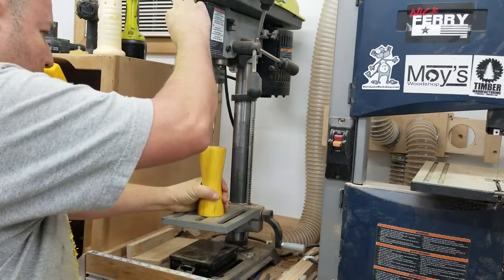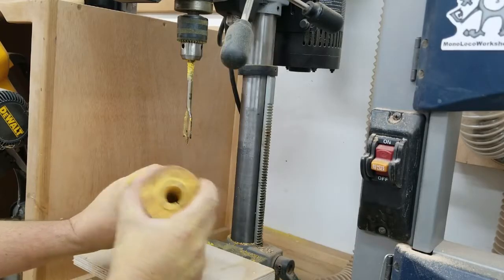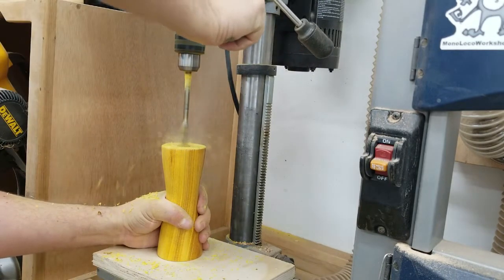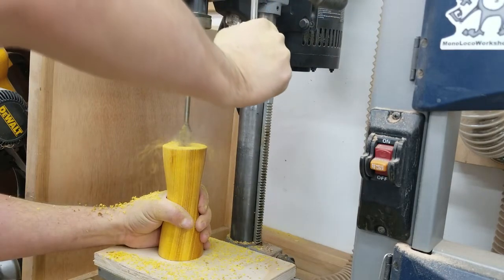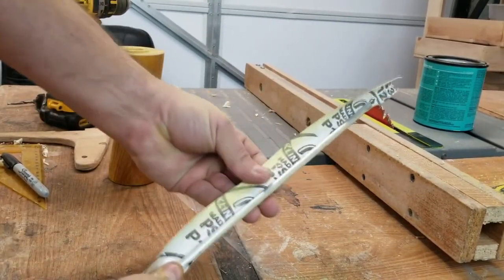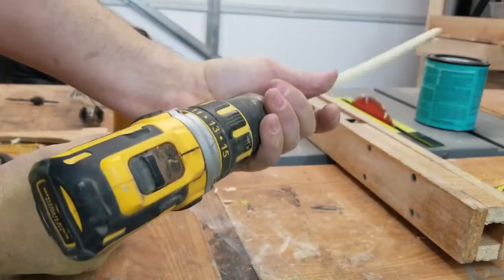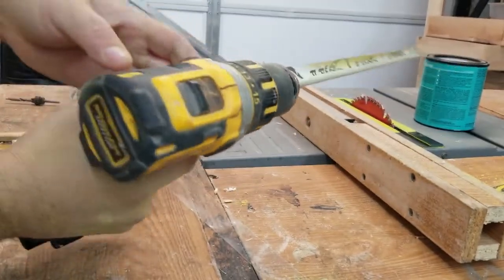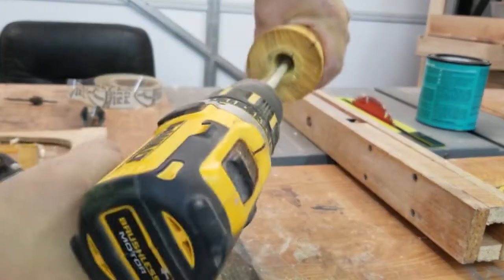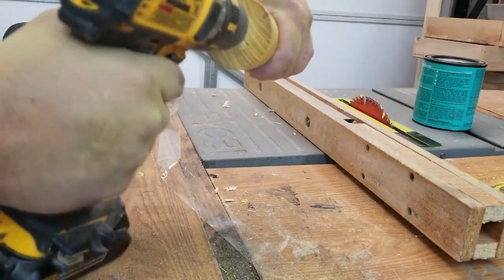After cleaning up the ends, I'm going to be using a 1-inch spade bit and the drill press — drill about halfway through, then flip it over and drill the other way. There are plenty of other ways to do this, but this is the option I felt comfortable with. If you don't feel comfortable doing this, don't do it. Both holes were a little bit off, so I grabbed a piece of aluminum rod and some adhesive-back sandpaper, chucked it up on the drill, and made myself an extra-large oscillating spindle sander of sorts. I was able to clean the inside up and you couldn't even tell that the holes didn't match up after that.